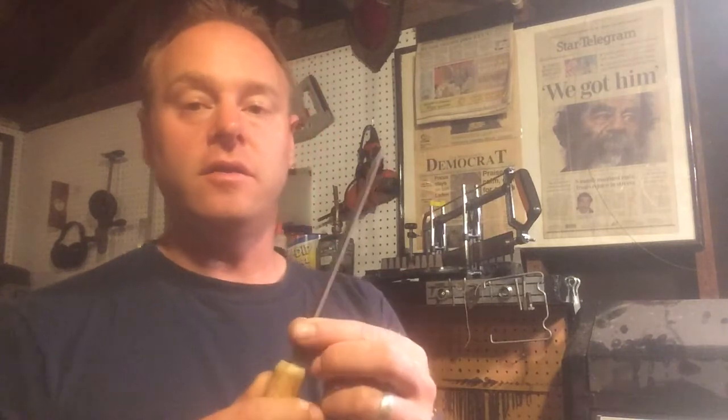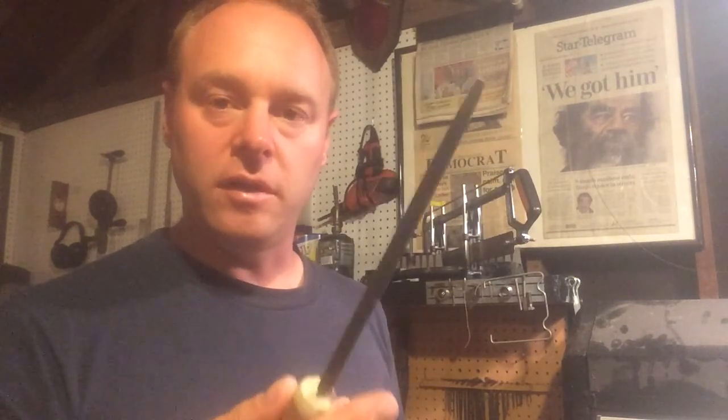The next item on the list is something that — this is one of the rare times you'll actually hear me say you have to have this tool to do a particular job. This is a three-sided saw file. This one is a Nicholson file, made in Mexico, that I think I gave six and a half or seven bucks for at the local hardware store. You can't do this job without this tool. Everything else you can make do, but you have to have this file. Eventually it will wear out, but it does pay to have a good one — it will cut a lot nicer and you'll do a better job sharpening your saw.